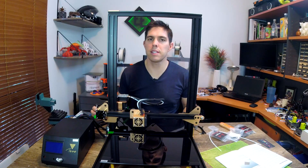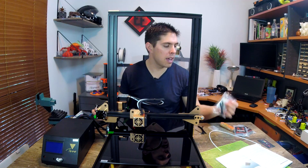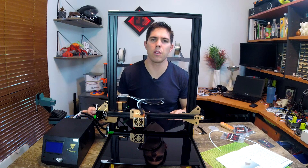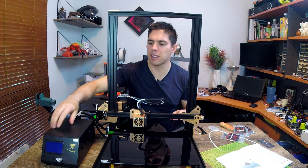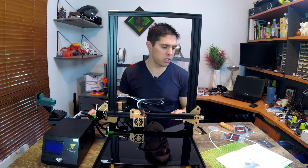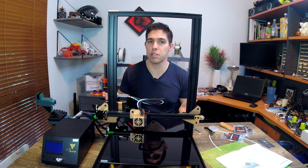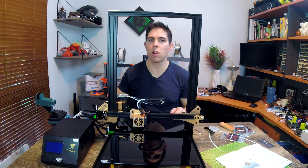Some first impressions: the assembly was very straightforward, everything was labeled, the instructions made sense, and we have some spares including a spare thermistor and spare nozzle. My only complaints are all the cables - there's nothing in the instructions about preferred cable management. I have a personal preference for an all-in-one machine and don't really like this box on the side. The heated bed wiring is especially important to get right because we don't want mains wiring to fray and potentially electrocute ourselves. It would have been nice to have more in the manual about securing those wires.